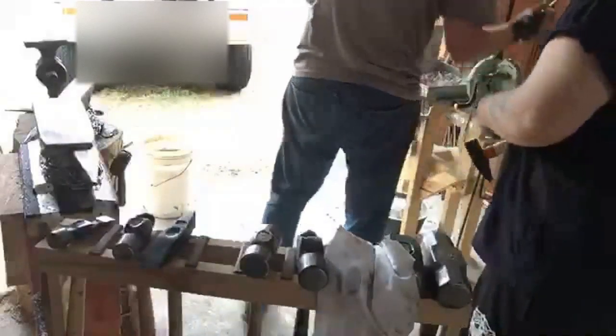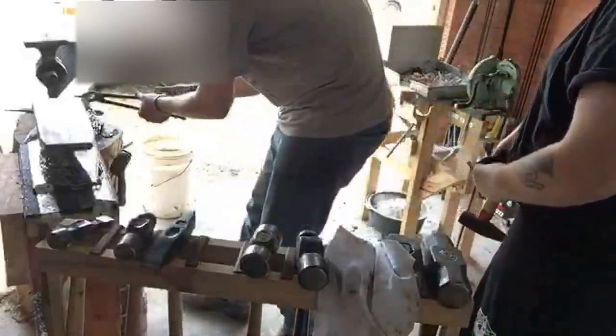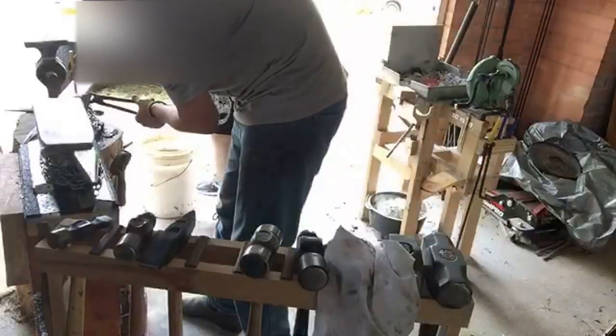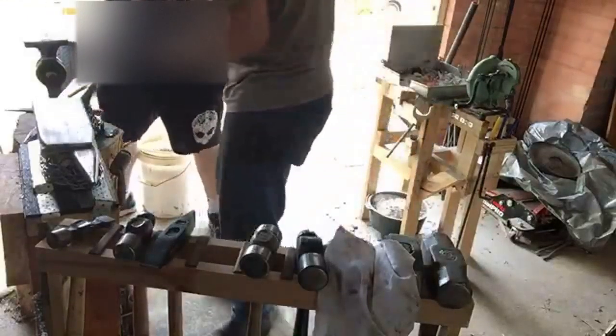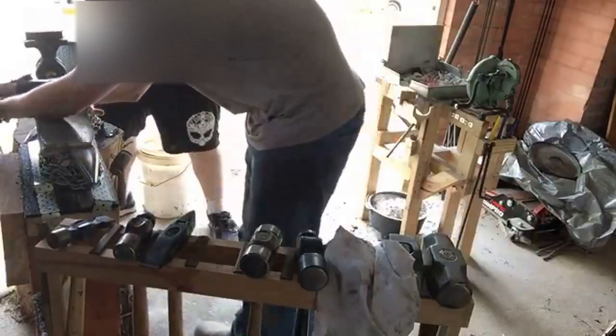What you want to do is grab your hammer. We'll start with a smaller chisel. I'll put it there for you on the anvil, and you'll come around here and with your left hand you'll hold the chisel, and you'll chisel out what you're going to actually do. Most of this will disappear under the heat, but use this chalk pencil to draw it on there. Because remember, he's upside down too, so I'll put it the right way up.